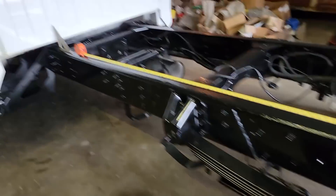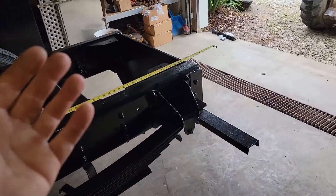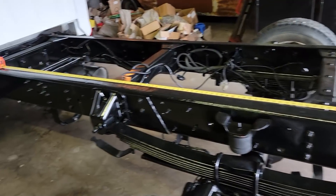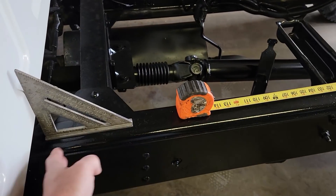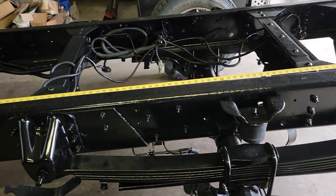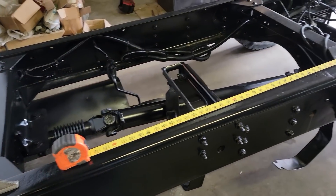Alright, it's a new day and we're back on the C4500 project. The next step is we need to mount the sub-assembly to the truck. When you order a sub-assembly, they're not always cut to the right length — they fit from one size dump bed to another. So sometimes you have to cut them. In my case, I'm going to have to cut about 9 inches off the front. I'm laying this all out now to figure it out, and I'll go pick up the grade and set it in place to do my measurements with the sub-assembly on top so I can get the right spacing.